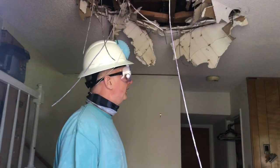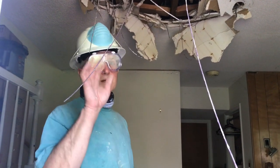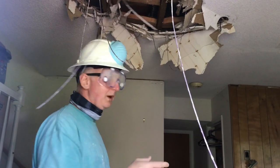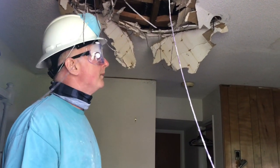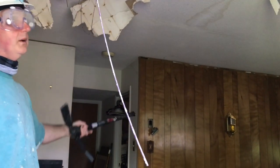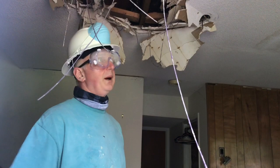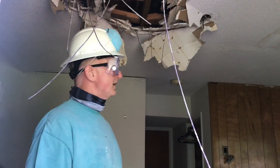Now, if you ever run into this, make sure you disconnect the power, because you don't want this zapping you. I believe it's running on 110 — one circuit was — but I found another section in the house that actually had 220 running to it. We went ahead and checked it at the controller, flipped breakers until we had all this cut off. When we're done, we're probably going to remove that breaker from the power box so no one will ever flip it back on.